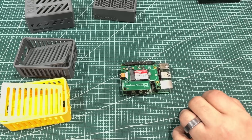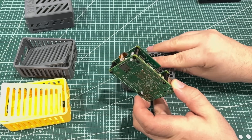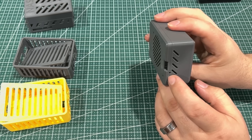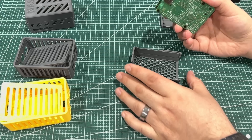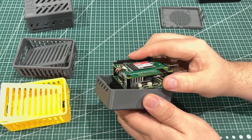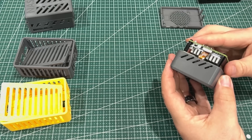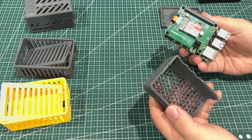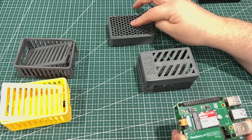I know I should have my rubber mat out, but it's okay — there's nothing critical on here. Let me see how this one comes apart and check for defects. Some of that's my printer's fault, some of it's the PETG, some of it's the design. Now this one — although I'm using the SSD — doesn't allow you to access the SD card if you're using one. That's a tight fit. It does not like my M2 hat, so that one is a bust. It's just going to be way too tight. I like that it had a lot of air holes, but it seems like you're going to compromise your structural integrity a little — maybe a bit overkill.